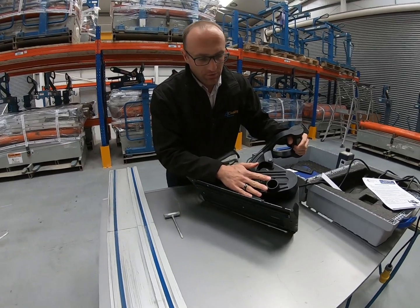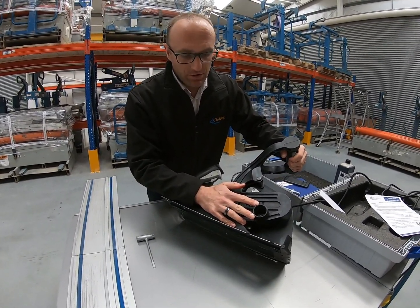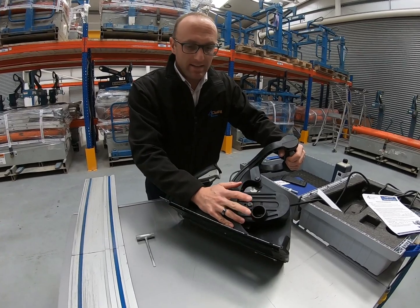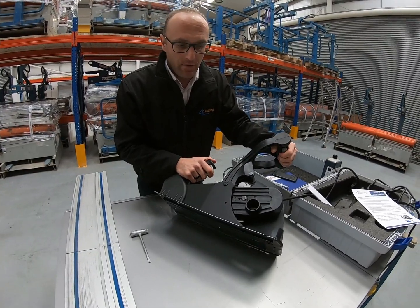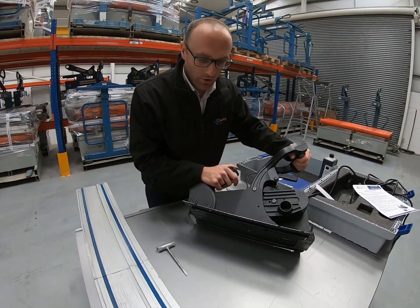Using on-tool extraction allows you to get the most out of the machine. It means there's less debris, less swarf going about, and less insulation — especially if you're cutting mineral wool — getting into your lungs. It's a lot safer and more efficient, and you get more out of the machine because it's doing less work with the extraction.